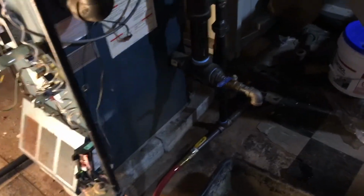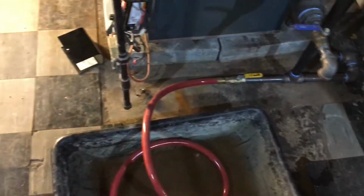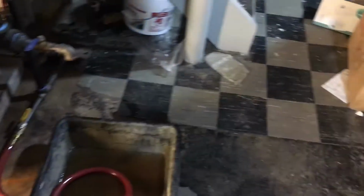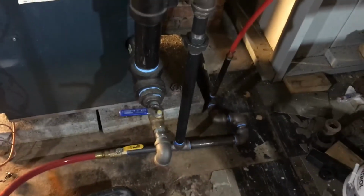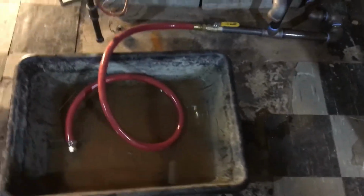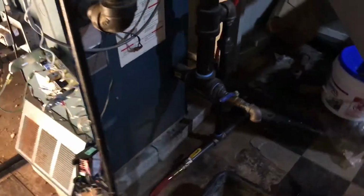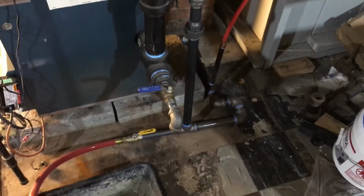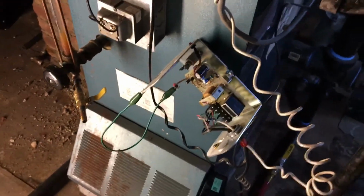So you're in one of these calls for heat, and you get this leak in your wet return. It's in your basement. I don't spend a whole lot of time down here. The idea is that during the time the Hartford Loop provides you, you're going to be able to notice this leak and do something about it as a homeowner, right? I do a lot with my steam system. I'm down here way more than any other homeowner I've ever met, and I'm still not down here that often. If I get a leak in my wet return, and if the low water cutoff doesn't catch it, I know damn well I'm going to start smelling a fire.